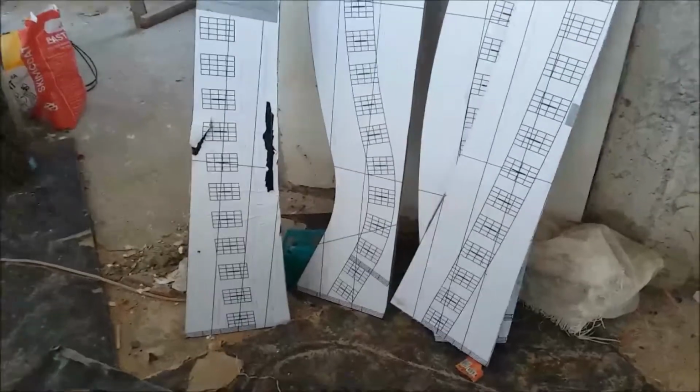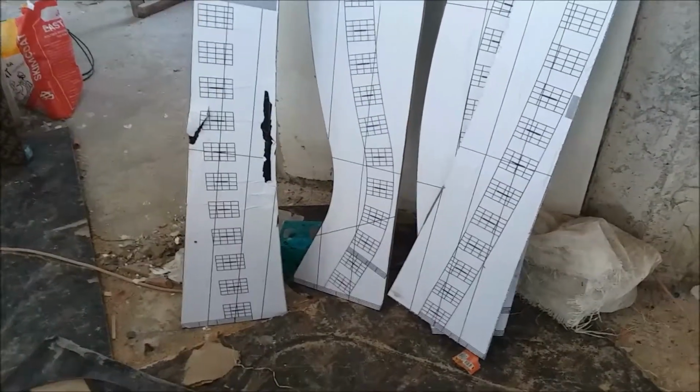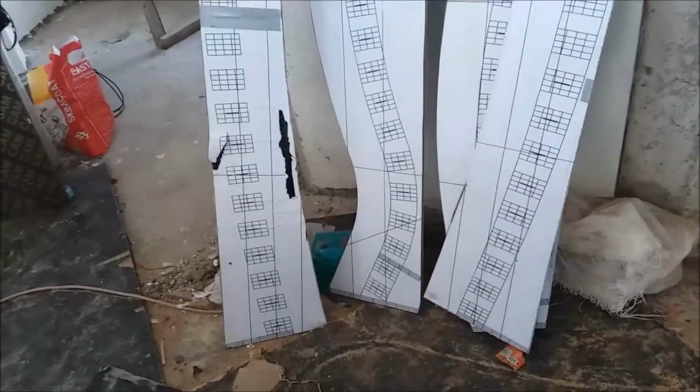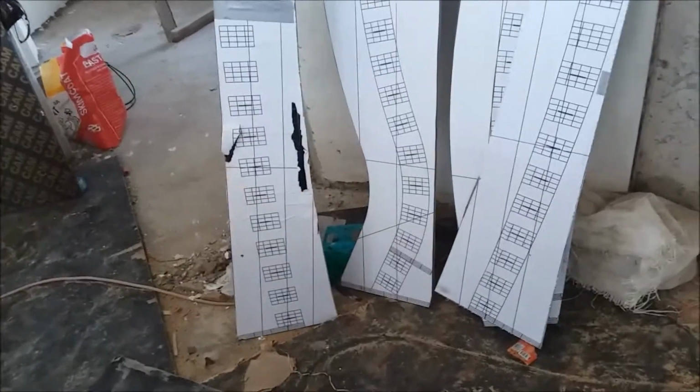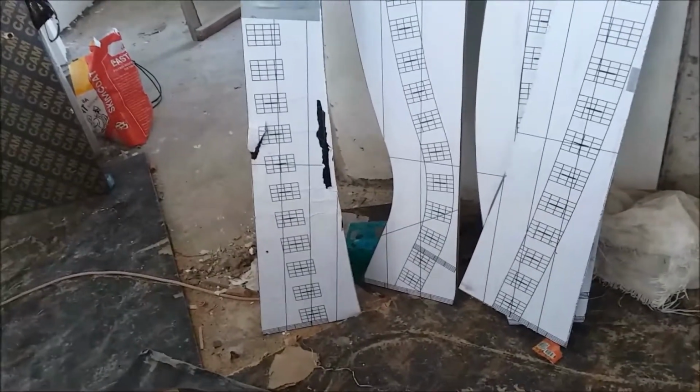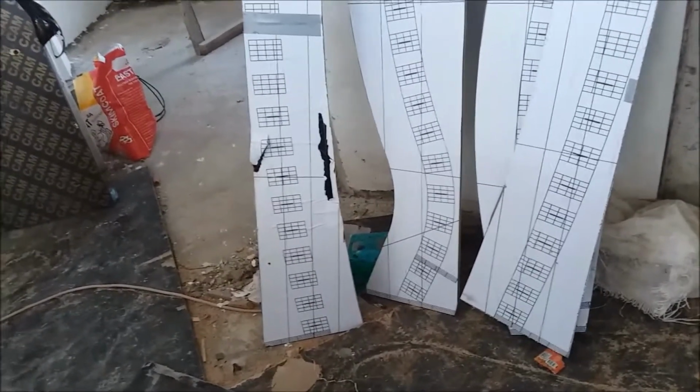If you have a straight counter, you don't need to do that. We're going to make some straight sections, same kind of box. Actually, we could probably make them by turning this box upside down, the longer one. Just lay a piece of lumber in there and have at it. I'm going to mention that to them. But what we've been doing is cutting a piece of 3-inch PVC pipe lengthwise, 180 degrees, 2 equal halves. And we put that into the edge of the form, and you fill your concrete up to the ID of the pipe.